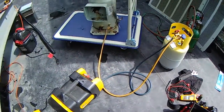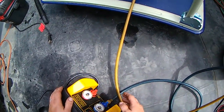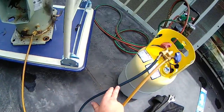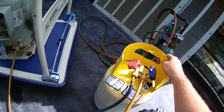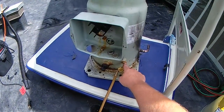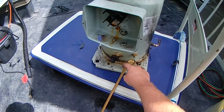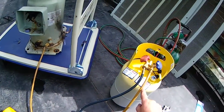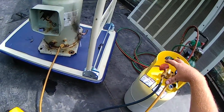I went ahead and got the vacuum pump set up. The suction of the vacuum pump is sucking from the vapor side of the tank, so it's drawn off the top half. The other side — the liquid side — has a tube that goes all the way down to the bottom, going to the oil port. There is a tube that goes down into there and it's sucking the oil off the bottom of the compressor and dumping it here, because there's a negative pressure above.